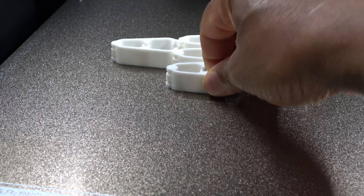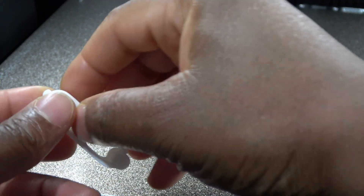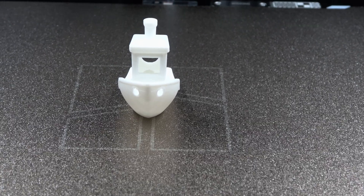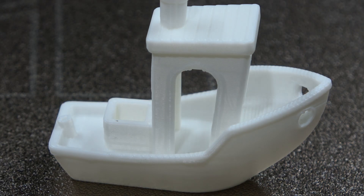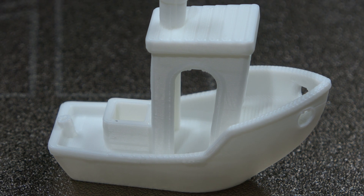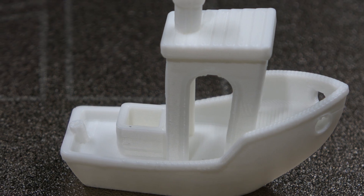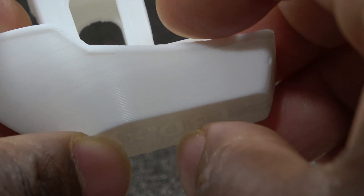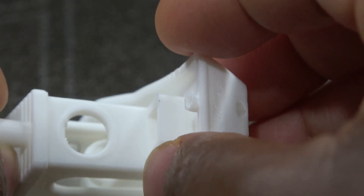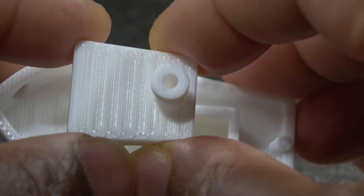Next is a quick practical print: this cable clip. I printed this simply because I needed a few of them for USB-C charging cables. Of course, I also printed a Benchy — every new printer prints a Benchy and for good reason. It reveals a lot in a short amount of time: hull quality, overhang behavior, small text, and surface consistency. The results here are very good overall. There are a few minor imperfections but nothing unexpected for a first print. The text on the stern is not fully legible, largely because the lettering in this particular model is only 0.1 millimeter deep, which is below what this setup is optimized for.